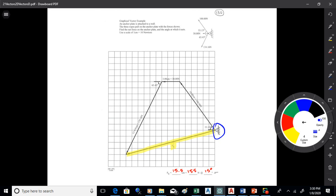Yeah, a question there? So let's take the safety factor into consideration, and then those 2, you just double that. Yeah. If I had a safety factor of 2, I'd double the 155, I'd make it 310, and that's what I designed it for. And that's very common. I think a common structural design safety factor is 1.4 or 1.5. Okay. All right. So that's the idea.